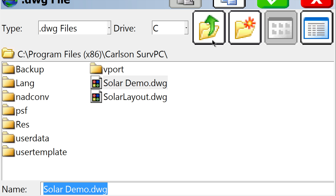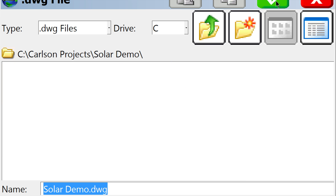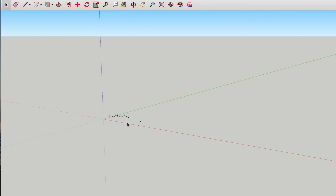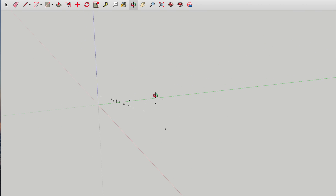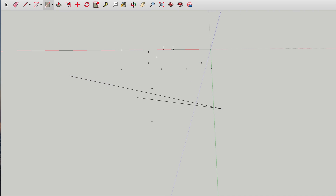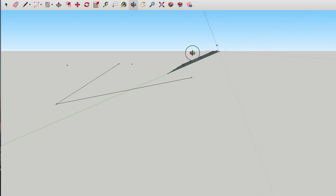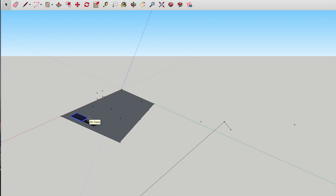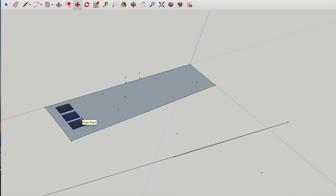Once data collection is complete, transferring the data is as simple as choosing the correct file type and clicking a few buttons. Then bringing the data to SketchUp takes just a few clicks. Once imported, we like to examine and check for any misplaced data. Here we can see our occupied point, our back sight, and the roof corners, as well as a few other shots we took for reference. We'll then use the line tool to draw vectors between points to provide valuable reference data back in the field. To start on our design, we'll create a surface using the four roof corners as a guide. Next, using the SketchUp marketplace, we'll find a solar panel template to use in our layout — this can be something you find in the marketplace or something you create yourself.